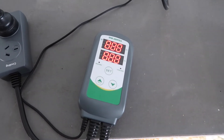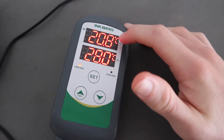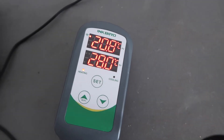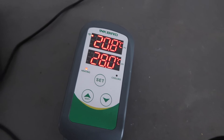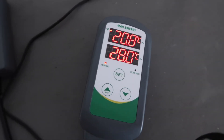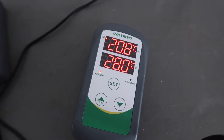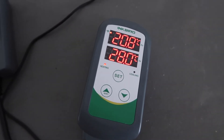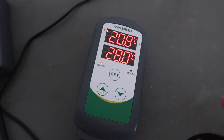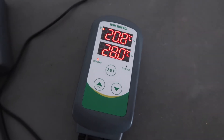So we've got our probe in here, picking up all the temperature readings from this light to make sure it's not too hot. From there we plug in the lead from our light into the heating side of the thermostat, and we're ready to set it up. When you turn it on, the reading on top is what the temperature probe is picking up — the actual temperature inside the enclosure. The screen below is what we're setting it to, what we want the temperature to be. The heating light turns on and heats up to reach that target. Like any on-off thermostat, once it reaches the set temperature the light shuts off. You can adjust the temperature range and how much of a gap — how much it needs to cool down — before the light turns back on. It's automatically set to about 2 degrees.